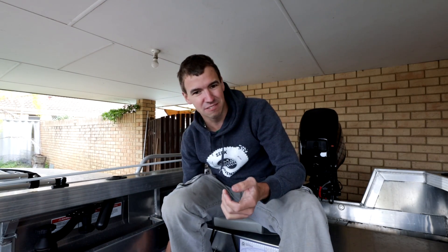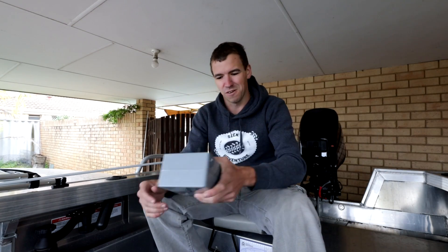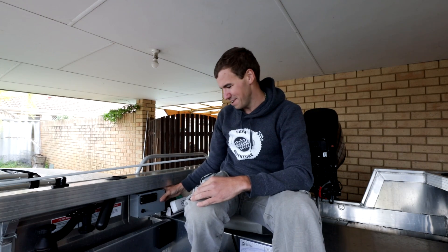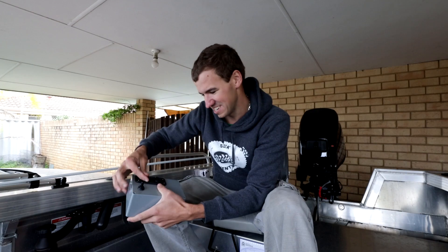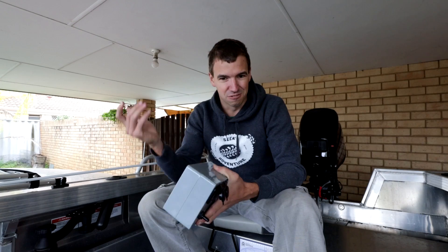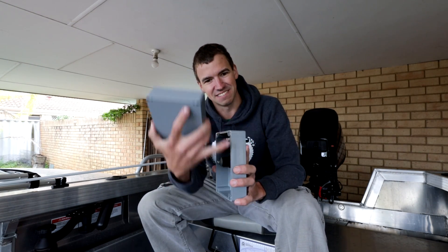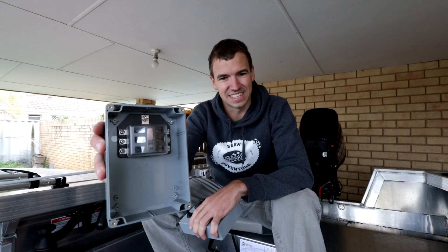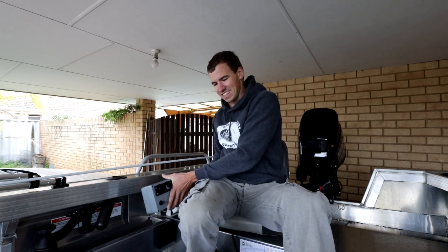What are we actually doing? Well, we're installing a 12 volt setup in the boat because I've added a few things that need 12 volt power. This is going to be the main junction box and it's going to sit right about there. Here we just have your standard 12 volt accessory socket, a couple of USBs and one switch. It's virtually a glorified lunchbox except it's got a rubber silicon seal on the inside, and I've also siliconed a fuse block in there as well, so that's going to make it nice and neat and very handy.